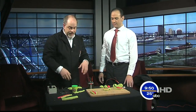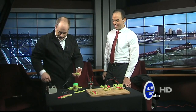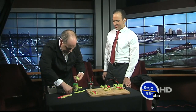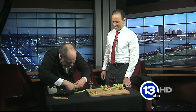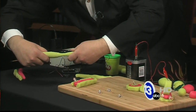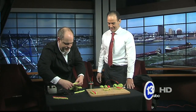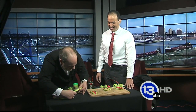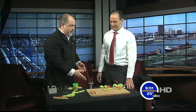You can explore all sorts of really cool things. We've talked about how some of the stuff is resistive or conductive. I've got this hot dog deal here — I built a little circuit that will tell us the resistance of this based on sound. So give us a little feedback. This little buzzer — hopefully you can hear it. But if I stretch the Play-Doh, listen to the sound. As it gets thinner and thinner, the pitch gets higher and higher. If I put it back together — low resistance. Stretch it apart — high resistance, and the pitch gets higher until it finally breaks. There's all sorts of cool stuff you can do electronics-wise with something as simple as Play-Doh, a few batteries, and some LEDs.